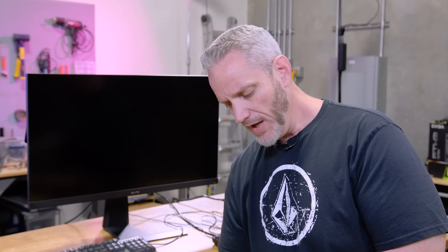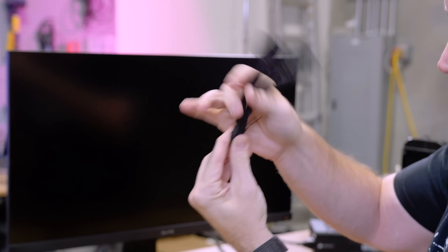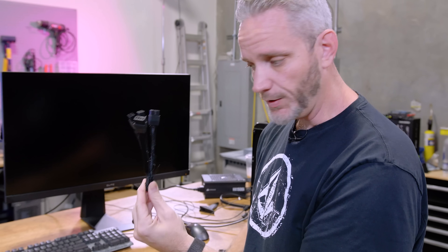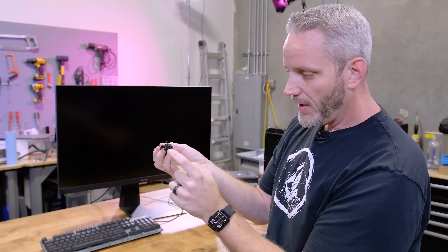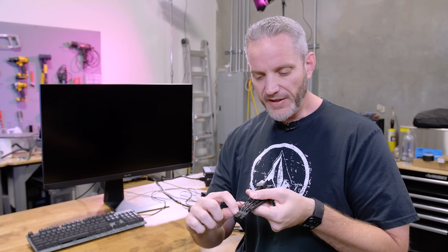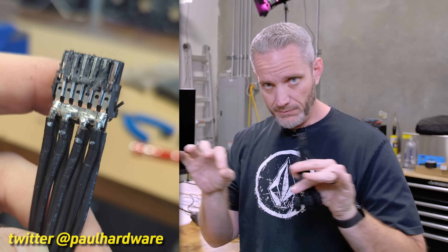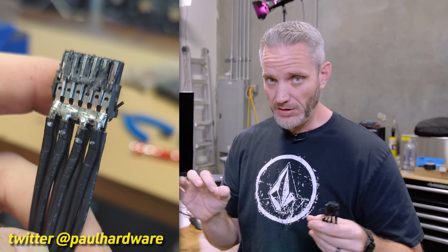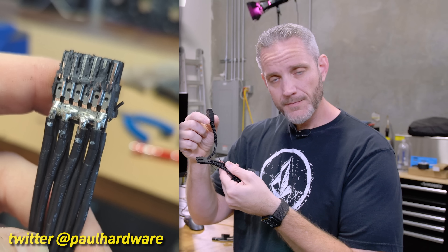What Igor found was that it's not bending the cable up and down that's as much of a problem — which is what I was trying to do. It was side-to-side bending that explains why you're noticing the outside pins being the most melted, because it would potentially create a crack or a break in the joint where the wire meets that flat PCB foil piece. It forces a wire to break off there, meaning now one of these is no longer connected.